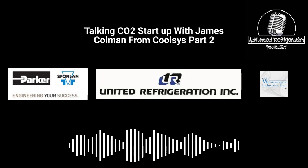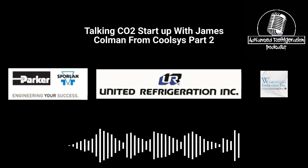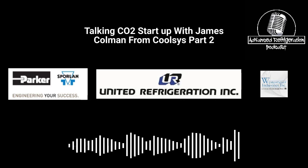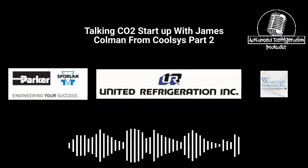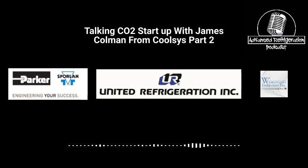There's been a lot of controversy about this, and I've been doing it like this and it's been pretty good - you just got to pay attention. I charge it after the liquid dryer - I want to go through the liquid dryers. There's a packed angle valve after the dryer, so you can shut the flash tank off and let it go through the store, feed through the cases. The reason I do this is I have more control. If it's feeding directly into the flash tank and we got a problem, I could dump a massive amount of CO2 pressure in there and the flash tank just spikes up, and I'm relieving.